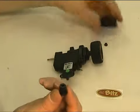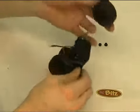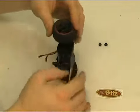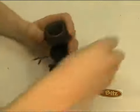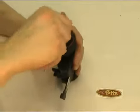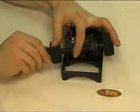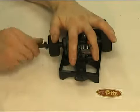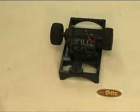This one's actually got that additional space, if you remember, so that can be mounted in the back of the wheel. And that groove needs to meet with the two ends of the pin. And again, drop your spacer in, just check it's over the thread, load up your driver, put a couple of turns on. Now, as we did before, just hold both your drive wheels and tighten up the nuts. Like that.